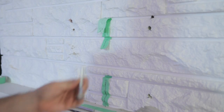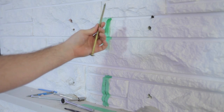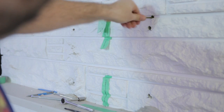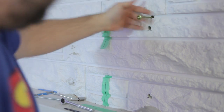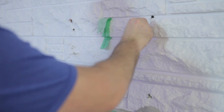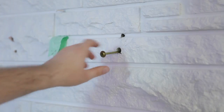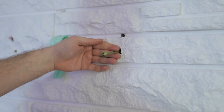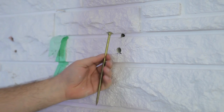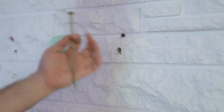So to replace the 6 inch lag bolts that were not quite going to get the job done, I went back to the hardware store and found 8 inch bolts. They were in the building supply section and the person told me it was an engineered, high-strength bolt that would be able to hold my TV mount no problem. The 8 inches gives me about two and a half inches of threaded space into the wood compared to the 6 inch bolt. These feel much better — in fact the 8 inches might be a little too much, but I think that gives me a bit more space to play with on the uneven surface of the fireplace. I also had to buy a special Torx head bit for my impact driver to put these in properly.